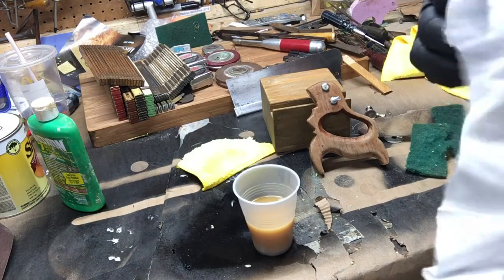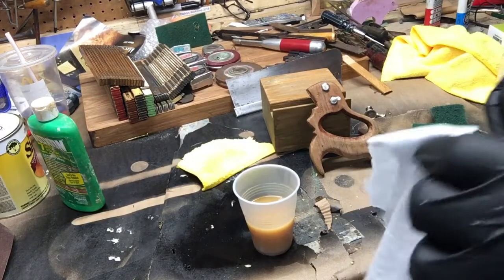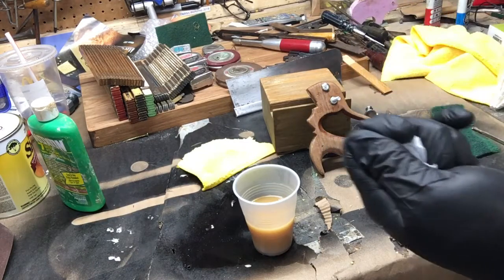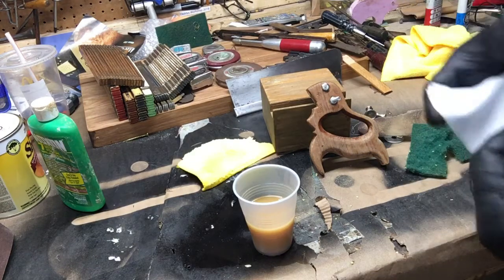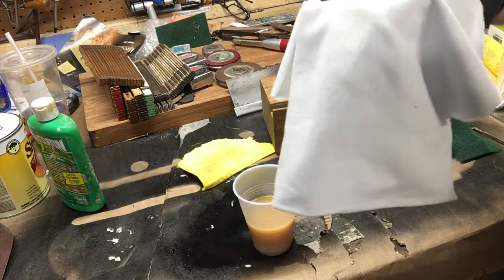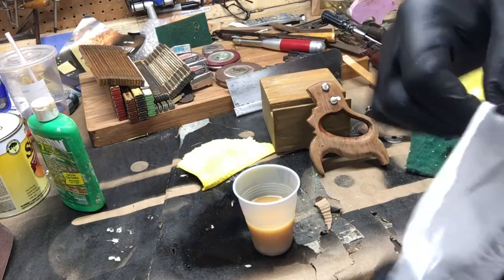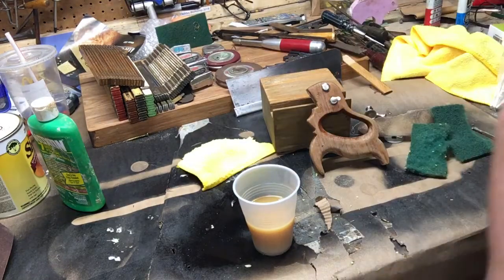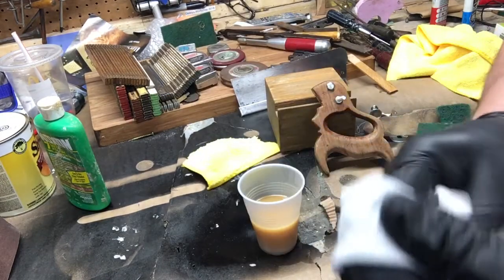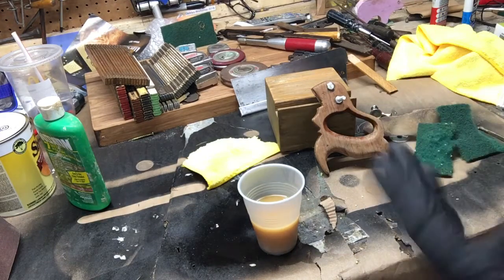Some of the tricks that I found are to do like a French polish. You need to basically wad a ball together. Alright. Wrap it with another cotton. One of the tricks is that some of these fuzzies get stuck on here and that ends up getting in your finish. So just want to give it a good shake. Get this crap off of here, because that's the most important part, making sure that the dust doesn't come out.